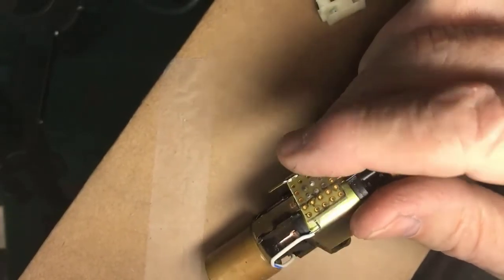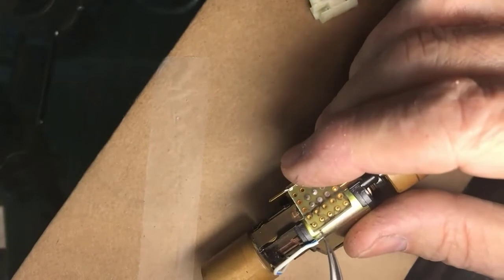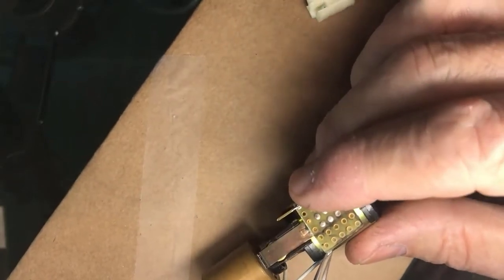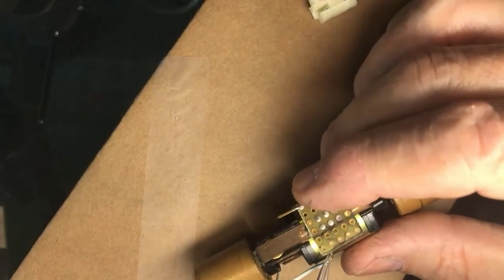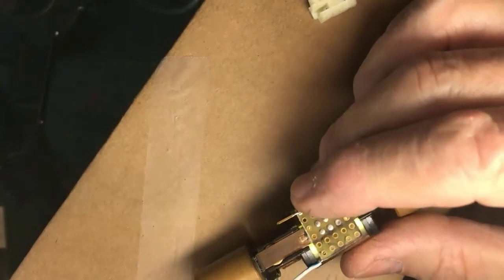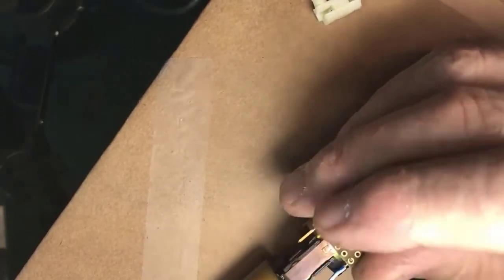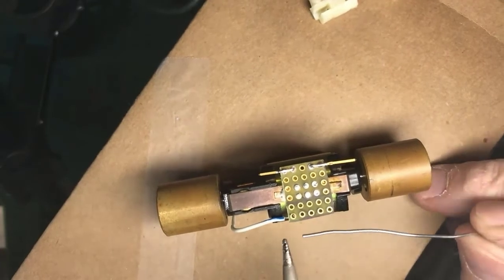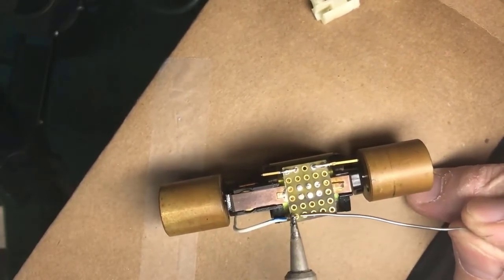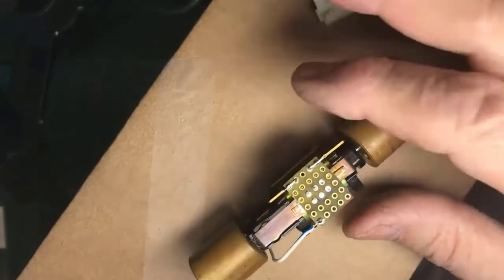Bring her down. Get the tweezers. This is the wrong tool. Come on. Come on. Bad word, bad word. Getting wires and model railroad stuff is always a pain in the teeth. Okay, so it's up in there. It's filling the hole. So I can again wet the tip, apply it to the work. Bingo. All right, so that wire now is the bottom contact for the motor.